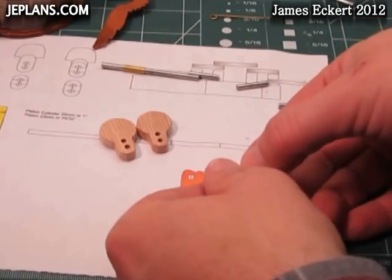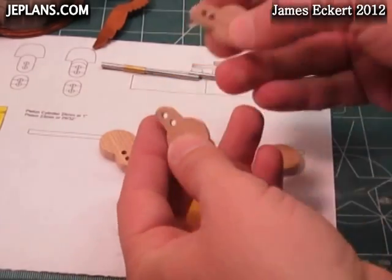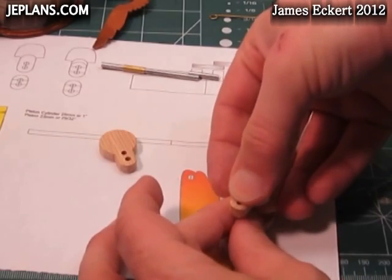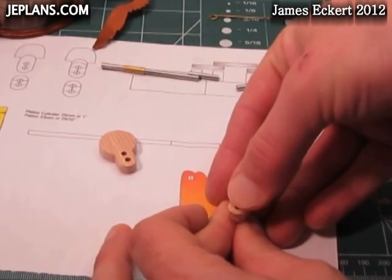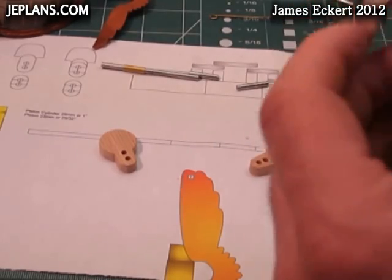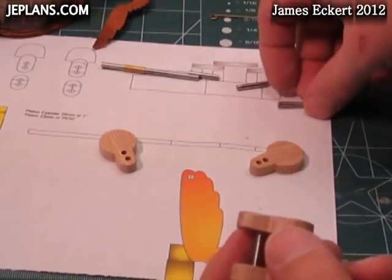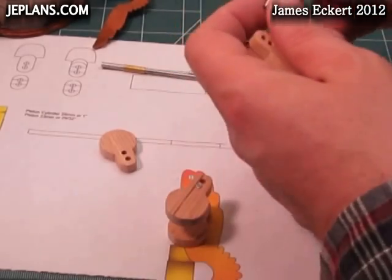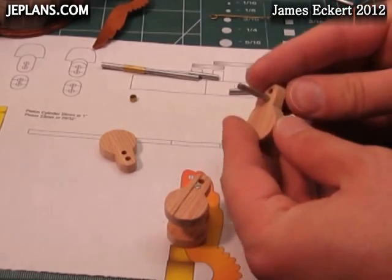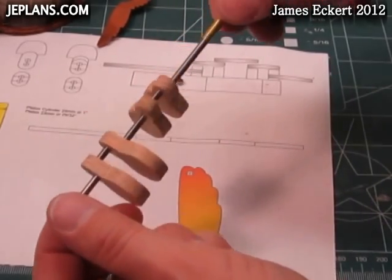This is the music wire cleaned up after the cutting. I'm just going to start with the middle and feed them into the pieces — the ones that are slightly shorter are the ones for the displacer. Once everything is done we may put some glue in there, but for initial assembly and testing it will be fine this way. On the end piece I have some small brass spacers I made, so I'll just push that in with a little effort to get the crankshaft assembled.